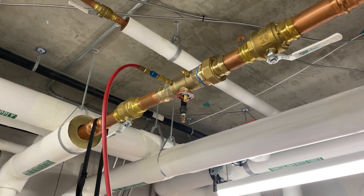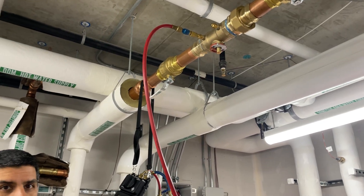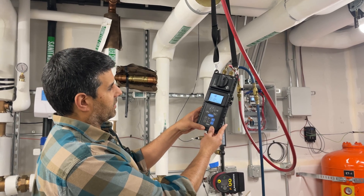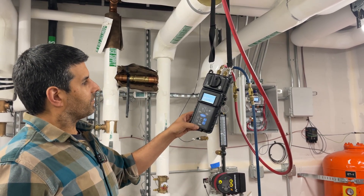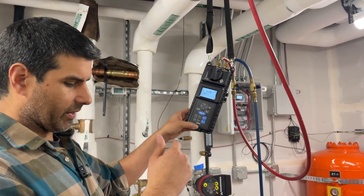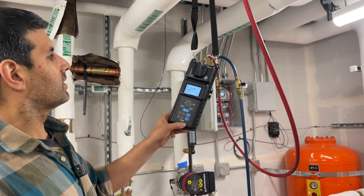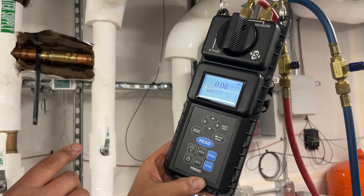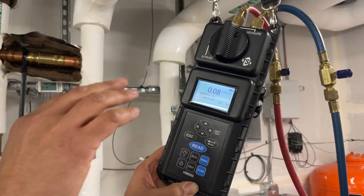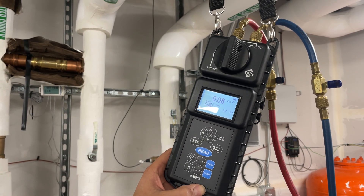The next thing we're going to do is purge air from the lines of the manometer so that air bubbles don't influence the readings. I'm going to power up the manometer at this point. The first thing it wants to do is zero the gauge, but we're going to re-zero it after we get everything ready for the final measurement. The meter is on — after it's zeroed, we'll see the readout in feet of water and differential pressure between the high and the low.